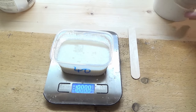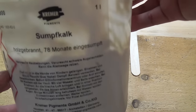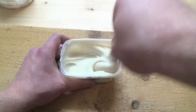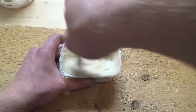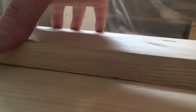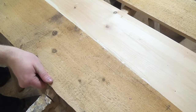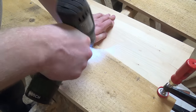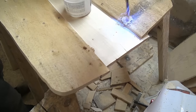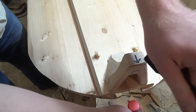Let's connect our planks now, of course with authentic cheese glue. I set casein with water overnight in a proportion of two to five, then add two thirds of the weight of the casein in slaked lime to the mixture. After mixing for 30–60 seconds it becomes really gluey. Because the shield is so long the planks stay apart at the middle, so we have to use temporary modern screws until the glue has dried — don't worry. In the original, dowels were used, so let's not forget them — mine have a diameter of 10 millimeters. For the nose, a simple screw clamp does the trick.